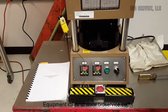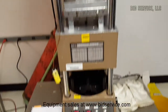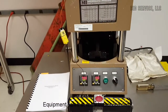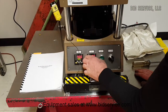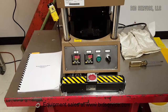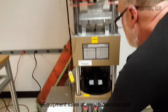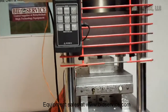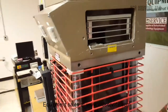You can manually operate the equipment to close the press and manually hold the shot as long as you want, or you can do it in automatic. Solely for purposes of our demonstration, I've set the shot to 10 seconds and the shot delay — the time it will be in the mold to cure — to 90 seconds. So in auto mode, we simply start and push our press-up, always using both hands.